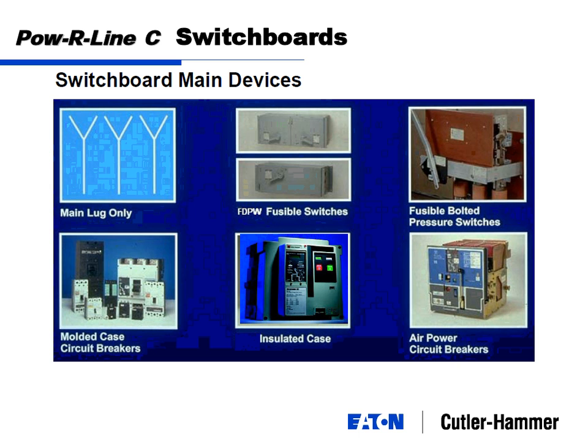A circuit breaker has a much lower number of mechanical operations than a contactor. And that's one thing, because a lot of people use breakers, and that's fine if you start them every other day or whatever. If you have a planned maintenance schedule, that's fine. But a lot of times you may get an application where you start it up 5 times a day and you're opening and closing that breaker, then you may want to think that better be a contactor application versus a circuit breaker application. So just know that there is a difference.